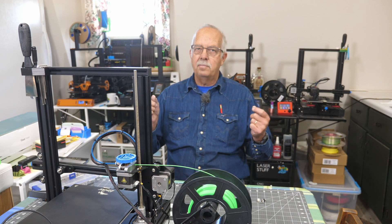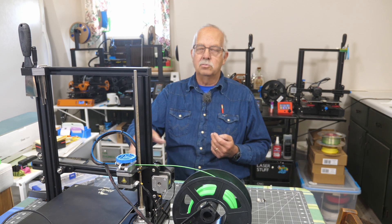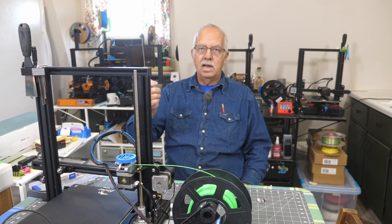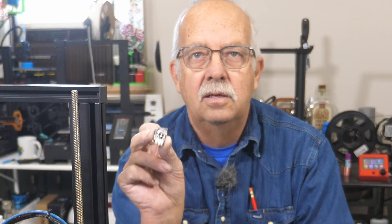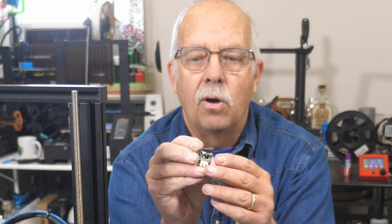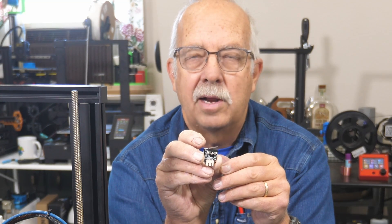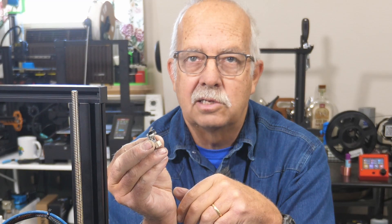I'm Roger, welcome to the loft above the shop. Quick short video here on this problem - maybe you've leveled your bed, hit home, and now the level is wrong: either too far away or too close. You re-tram the bed, take it back home, and it's off again. How can that be? Well, it's a little two-dollar part right here - it's a Z-axis limit switch. These fail; there's a little hinge in here and it gets weak. When it's weak it doesn't always stay where it's supposed to, and if it moves by just a tenth of a millimeter it's going to throw your nozzle clearance off. I'll show you how to replace this - it's very simple.